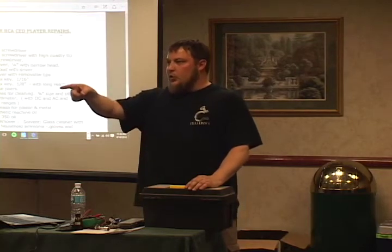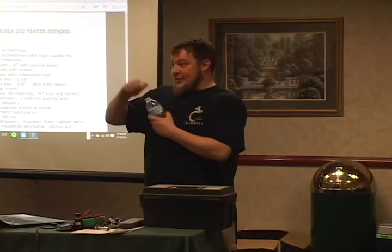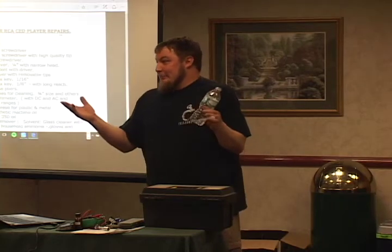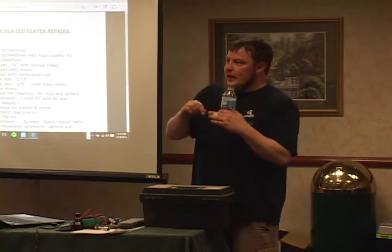Yeah. The thing with that too is that tool I gave you, there you go. That tool. You want to take the turntable out and set the turntable shaft to its 15/16. Even RCA for some reason said 30/32 instead of 15/16, you know what I mean? You set it to that, and I usually put a little super glue in there. I can show everyone when we go to do it. Like when you take that nut out where the Allen screw is, you lift the turntable up and out.